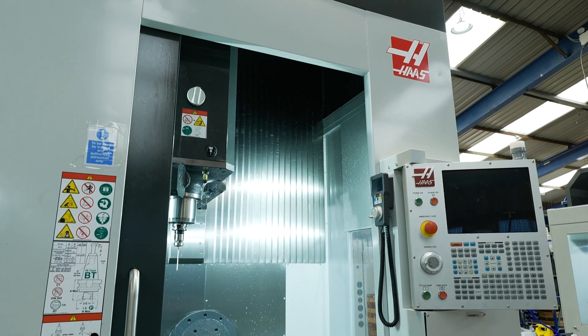I first met William 18 months ago — he had an issue with setup times on his 5-axis machine. He was doing small to medium batches and he wanted something that we could change over quickly and get more parts on at once, so we designed the first system for him. The first system included a UMC 500 from Haas and we had to design a base plate that would cover the table but still fit inside the envelope, and we put plenty of fixed jaws and vice jaws on there so we could hold more parts at once.